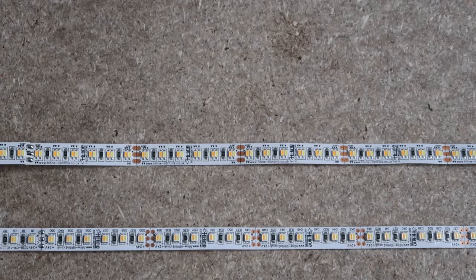This might lead you to think that the 120 LED strip would put out considerably less light, but this high-quality strip actually surprises again. At an efficiency of 143 lumens per watt, compared to the alternative strip's 96 lumens a watt, it'll give you an almost identical light output per metre for two-thirds of the power consumption. I think overall, and slightly dependent on your budget, it seems that the 120 LED strip would be the winning option quality-wise.